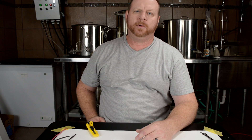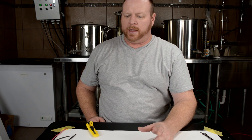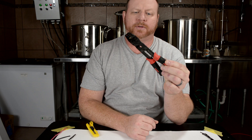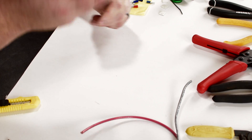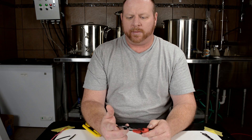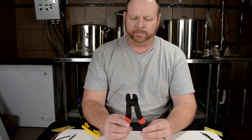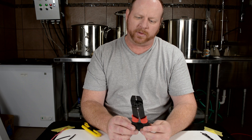Alright, let's get into what tools you're going to need. There's a few tools that are vital and then there's a few that are optional. Definitely you're going to need a pair of wire strippers. Common wire strippers out there are these, and I don't really like these a lot because they have a huge space in between and it's a pain to strip everything properly. These are also a crimper and I don't think they do a very good job — they will get you by in a pinch. It's even got a cutting jaw on it; you can also shear bolts off. But with anything that's multi-use, I think probably the only thing good for that was a Swiss army knife.